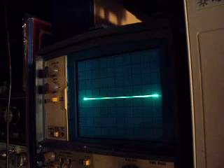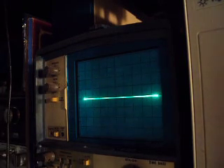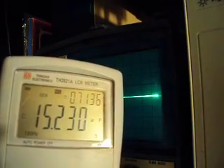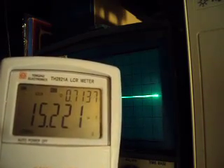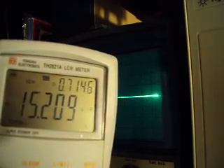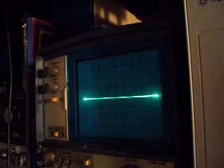Of course, if it were in circuit, there may be a resistor to explain that leaning. So you would definitely want to unsolder one side — it doesn't have to be an old capacitor; a lot of new components can have a failure as well. I'm going to put this capacitor on my LCR meter — here it is, measuring 15 microfarads with quite a high dissipation factor at 120 cycles on test.